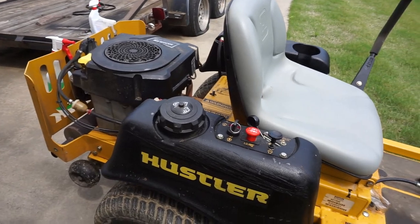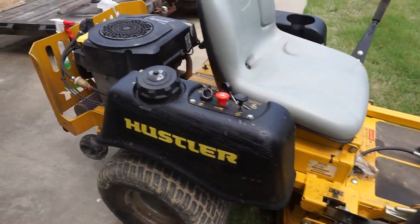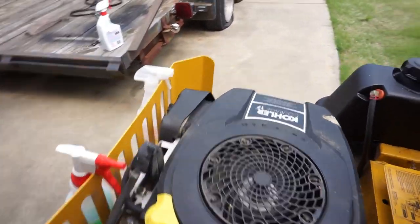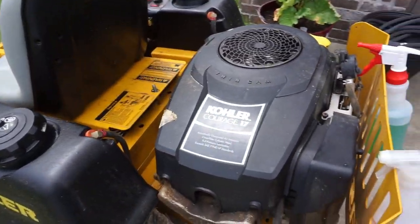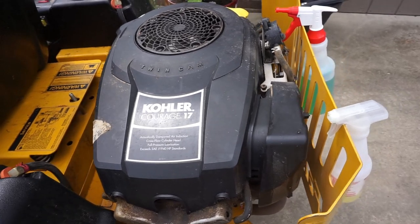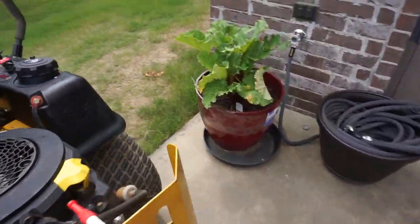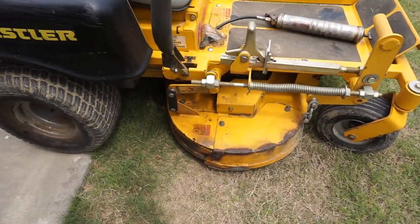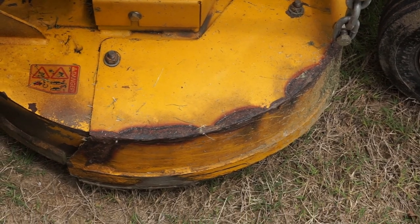It's not pulling from one tank, so we're going to have to do a little discovery on it. I thought I'd go ahead and spray her down with some cleaner and give a good bath. I don't believe this is the mower he sent to the shop, because when it went to the shop it had a Honda motor on it — now it's got an old used Kohler Courage. I believe it was a 19-horse Honda when it left here. It also had a rear discharge, and now it's got a cobbled-up mulching blade cover.